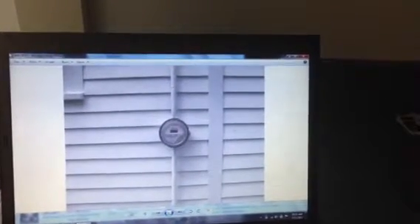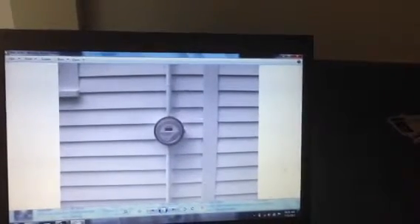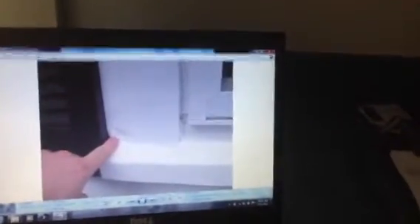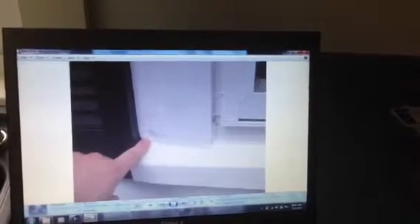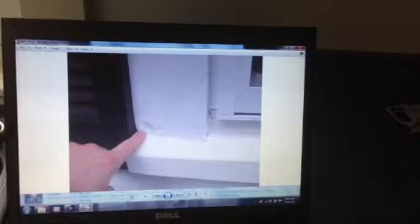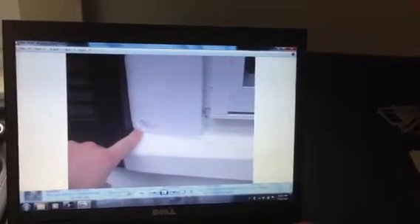There's the electric meter, which tells me there's 60 amps of electrical power in the home. Normally we'd have 100, but this isn't a huge house — I think we could still get away with the 60. There's also a little bit of rotted trim; it's a little punky wood, but nothing needs to be replaced right now because it's well-caulked and painted.